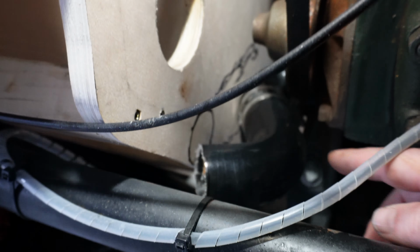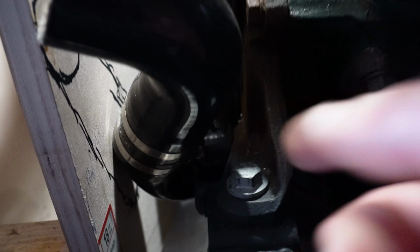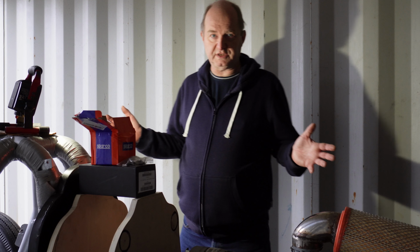So I'm on the other side now. You can see this hose is partially pushed on down there. Then I'm going to hammer out a recess in the aluminium here, and then the hose will come up and the port will be there. You can see there. And if you look at the alignment, it'll miss this pulley by about 1 or 2 centimetres. The top hoses are easier, they just come up the traditional way. They'll come up here, join on there. Same for this one, join on there, missing the fan belt here. So just a few things on the job list.